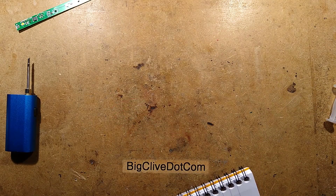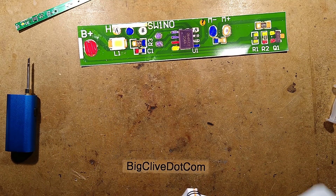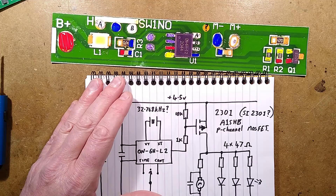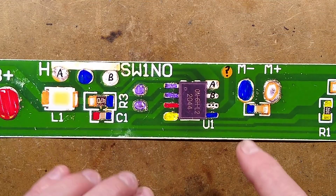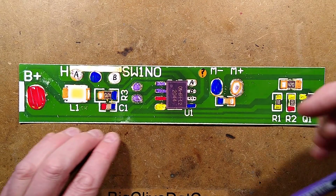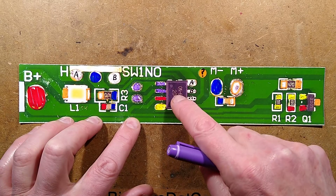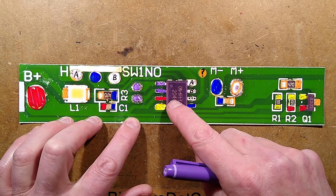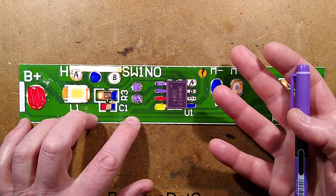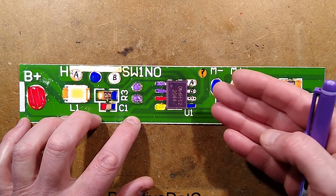Now let's get on to the circuit board. So here is the circuit board. I'll bring the schematic around and focus down onto the table. This chip is only used for the timing function - it's technically also doing the power on/power off, but in reality it's kind of redundant. It's marked ON6HL2, at 2044 - I'm guessing 2044 is the production date: 2020 week 44. ON6H is the 6-hours-on, 18-hours-off timer, so the fireplace lights itself at the same time every night once you've turned it on. I get the feeling this is just a little microcontroller custom programmed with that cycle.